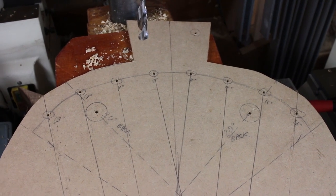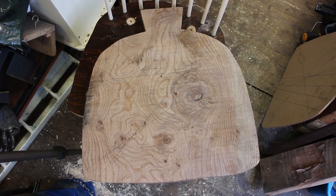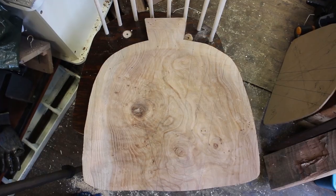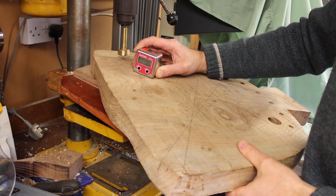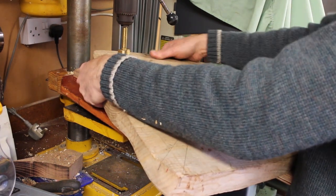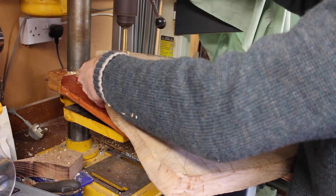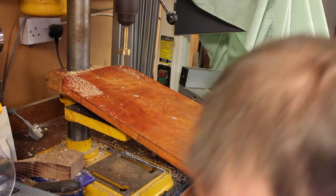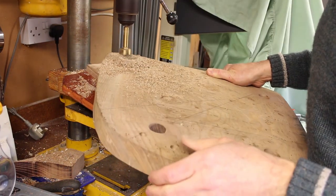This is my pattern board — all my sight lines are drawn on there, so if I want to replicate this chair later on I can. I've now translated my drilling angles onto the underside for the legs and onto the upper surface for the spindles. I'm now drilling the front legs from the underside of the seat board and checking my angles very carefully. I've got the back legs and spindles drilled and I'm just doing the front bits — double checking, I do not want to get this wrong. This elm is so tough.